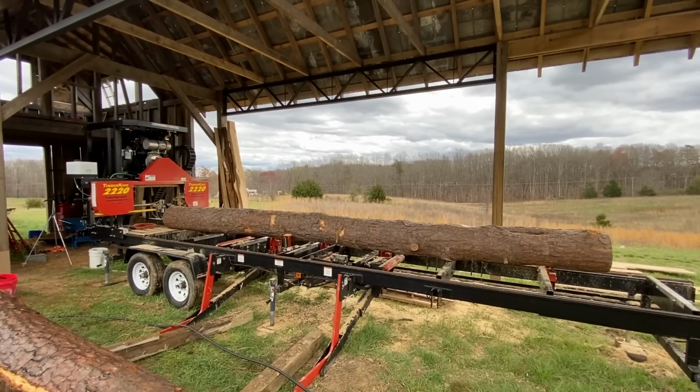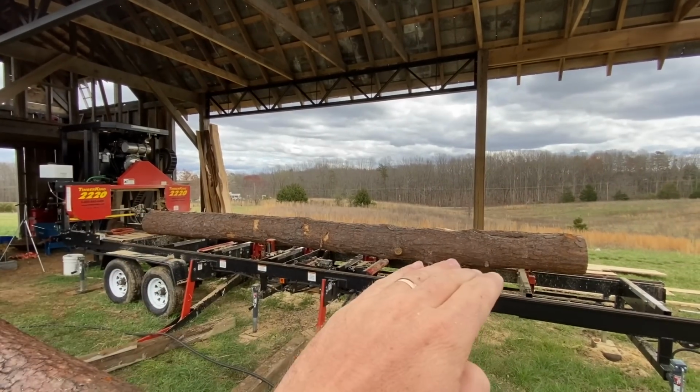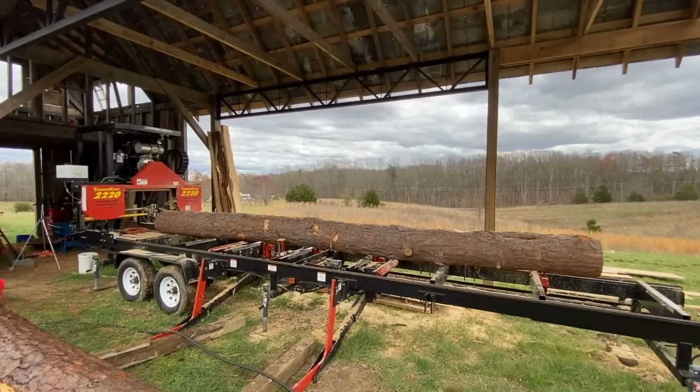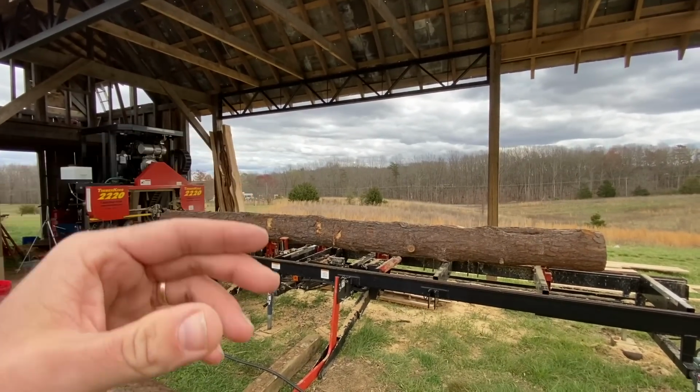We are ready to go. When I fire up the mill, the first thing I'll be doing is rotating the log to where I can establish my first cut. I'll flatten that out, rotating at 90 degrees, cutting as I go, working my way until I have a four-sided, just square beam, basically. And then I will start taking the 2x8s out of that.